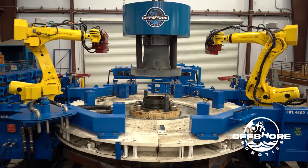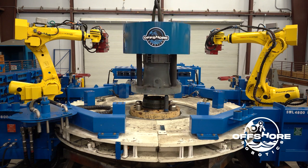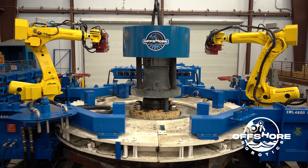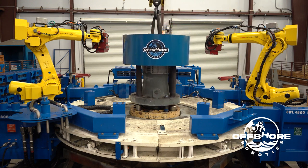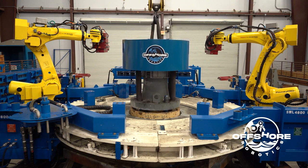A lot of the robot moves are made such that the robots can work while there's a load above them. So we don't have to pause operations on top of the spider — they can still do tasks as the drillers are manipulating and moving the riser sections into place.